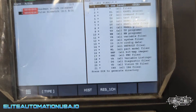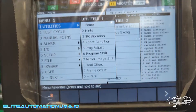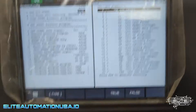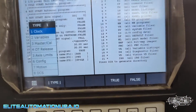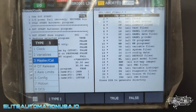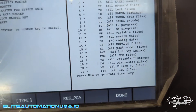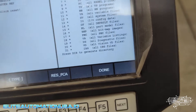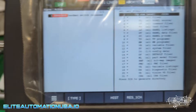Go to the system menu: menu 06, system. I just hit the number keys because it's quicker, then type the Master Cal screen. Sometimes the Master Cal screen isn't there. You'll see Master Cal reset, PCA reset — and you're going to reset the pulse coder alarm. Hit reset, menu 4.